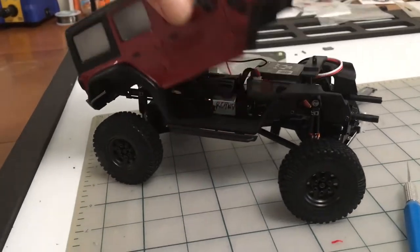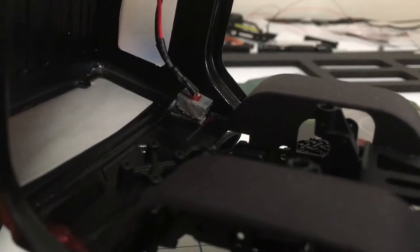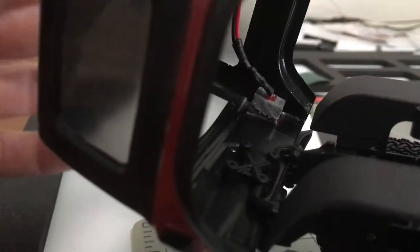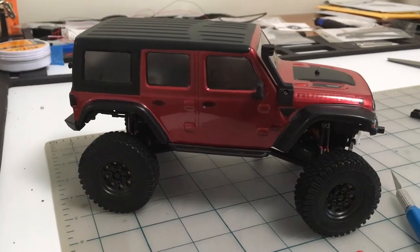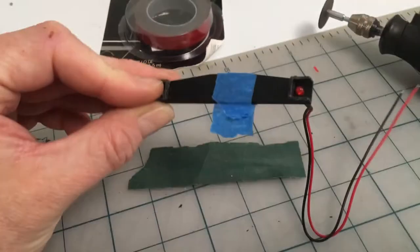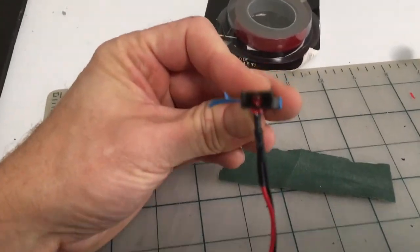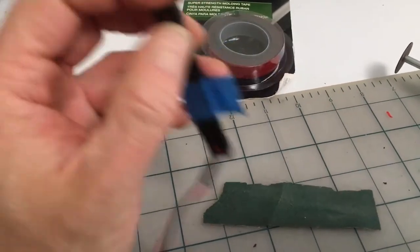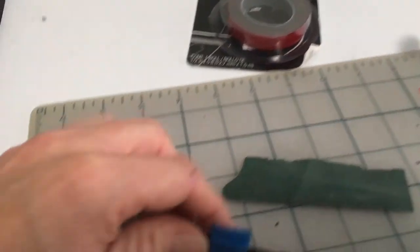The test fit seems to work well. I had to carefully bend the leads coming out of the LED close to 90 degrees to get those to come up over that arch, but it closes easily. So looks like I'm going to cut up the black one. You can see I got this trimmed up, got the depth taken out where it just fits the LED, and once I put some tape on there it'll add a little more depth. I got this one done, this one looks a hair uneven - back to the sandpaper.